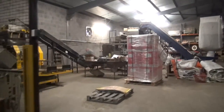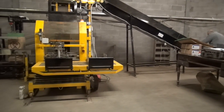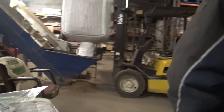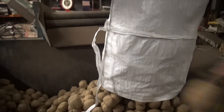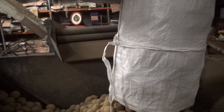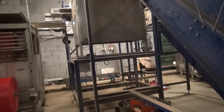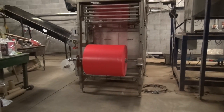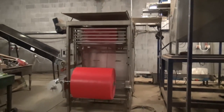That's basically that part — that's huge. I've got a bag in five places. That machine pumps them into the bag. This is where it all starts. They've been graded out — our size is 35 by 55mm. And then you get sized up. That part actually weighs 2 kilos — it picks to the nearest 2 kilo and dumps whatever buckets it wants. This machine here basically makes a cone bag between the film and the column on the side, welding it together with heat. It's a vertical-horizontal packer.